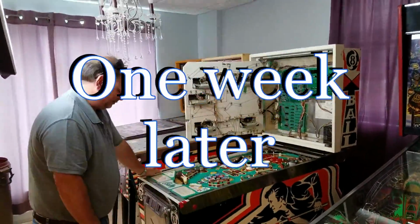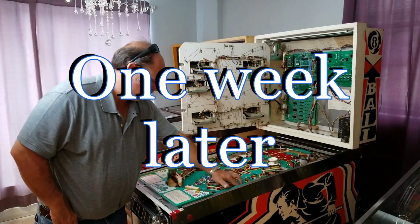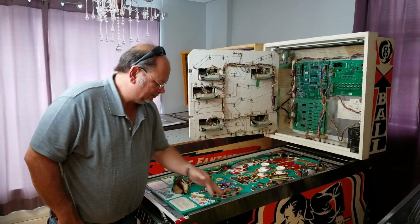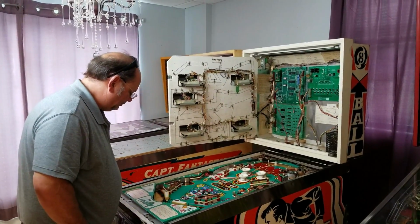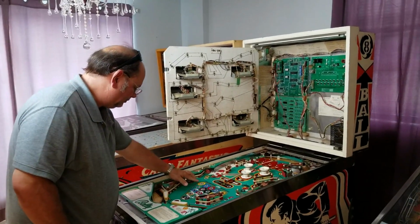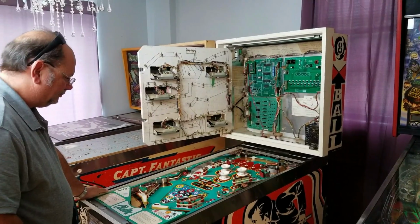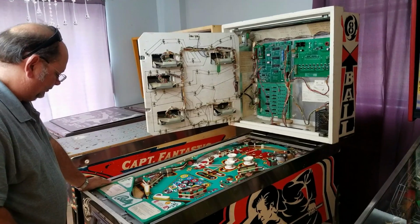Okay, we are back at the pinball machine. I have taken the board back, looked at the code in it, found at least one bug that would explain a lot of what was going on the last time we tried this. I'm not sure it explains everything, but I couldn't find anything else. What it was, I just didn't allow enough buffer storage space to store all of the 100 LEDs when we laid the board out. So now there is adequate space for that, and hopefully that will fix all the problems.